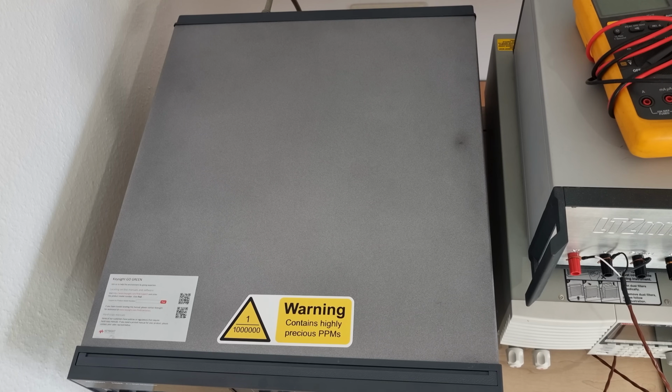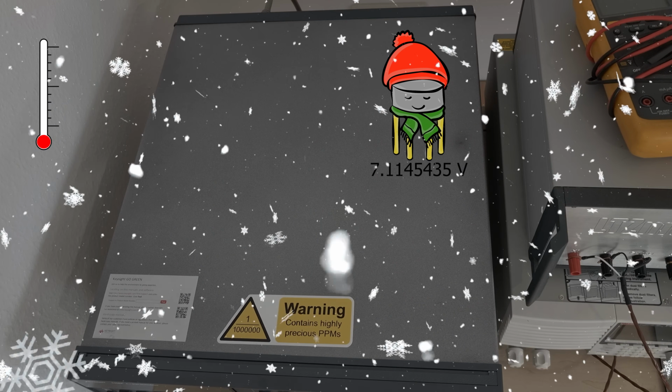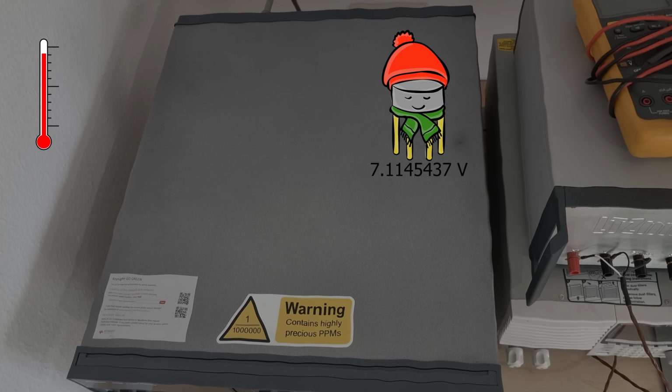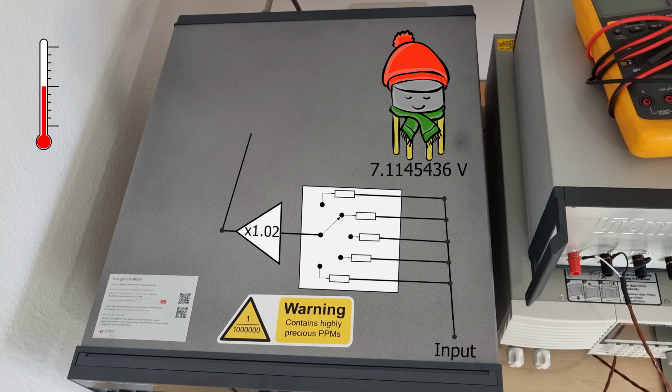It's based on our old friend the LTZ1000A ovenized voltage reference. Hidden inside of its own temperature-stabilized can, it couldn't care less about outside world weather. It drifts so little that it's the next best thing to negligible. The effects that we have just witnessed are coming mostly from the front end, from the input buffering and scaling, and from the ADC. All large components that are not so easy to ovenize.